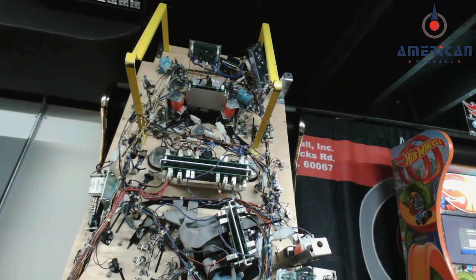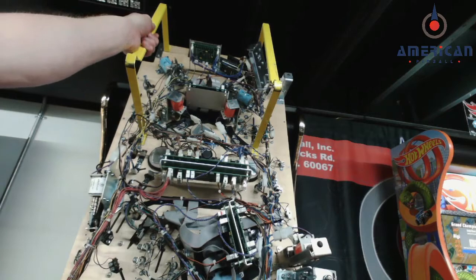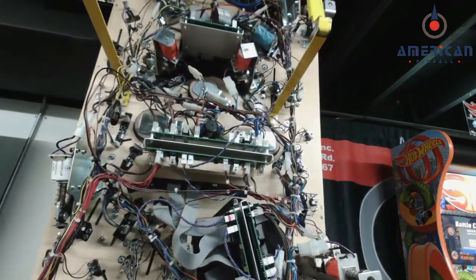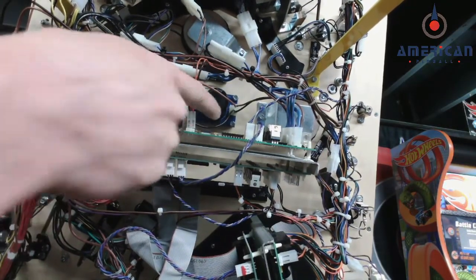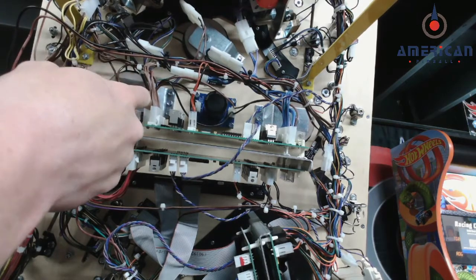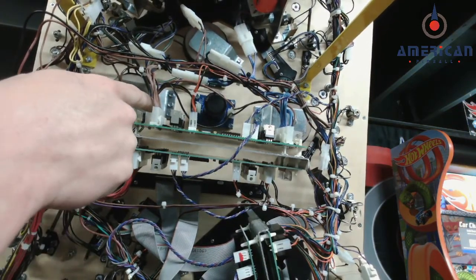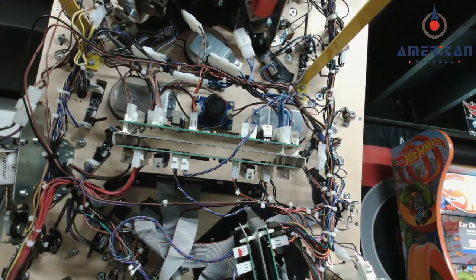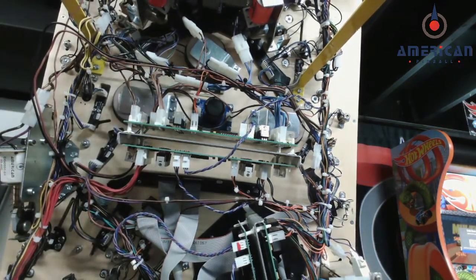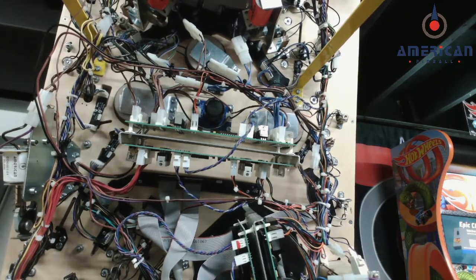During multiball in Houdini, all the magnet coils are working, your flippers are going, and several other coils are firing at the same time. This puts a lot of strain on your power supply, even the upgraded one. This kit is very simple — it is an inline capacitor for those brown and black 48 volt DC wires from the power supply. It's a small capacitor board that screws into the playfield between the three magnets. You unplug one of the 48 volt power connectors, connect it to the capacitor board, then plug the supplied connector into the other end and back into the board. I'll post a link in the video notes for the written instructions.